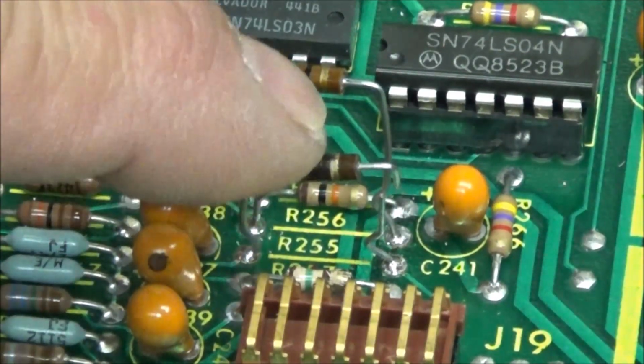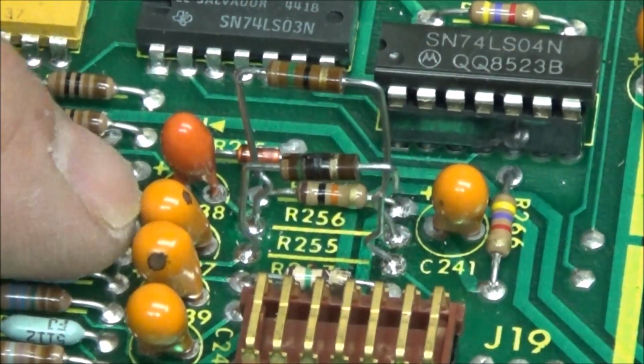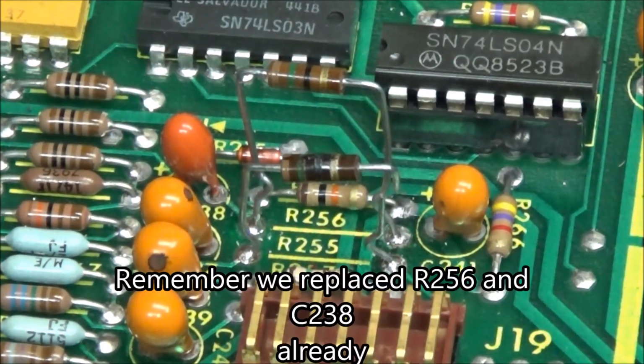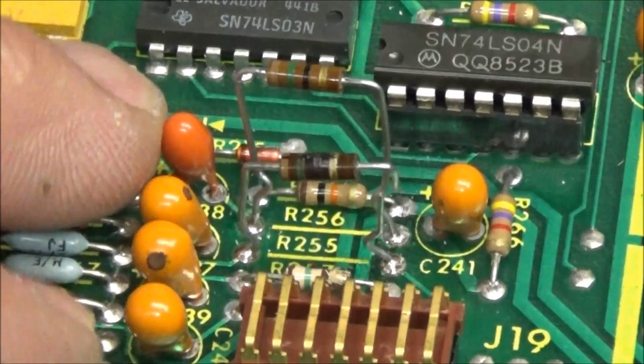and when I checked, what I found was this second tantalum decided to commit suicide. So I've already gone in here and made a parts list, and there's 62 tantalum capacitors in this unit, and I think that was a total of 6 electrolytics. So these tantalums are a nightmare.